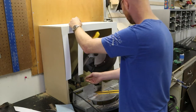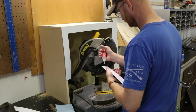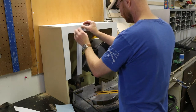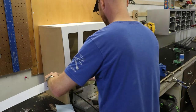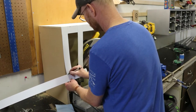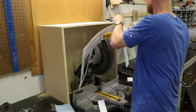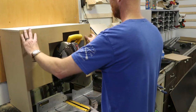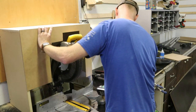From this angle you get a better idea of what I'm talking about. At the bottom I want enough room to put my hand behind there and adjust the fence or anything in the back. On the top and direct sides I need enough room for the saw to come through at any angle — I'm just eyeballing and double-checking that. Once I had that template done, I took it over to a piece of melamine, put it on the back side, and now I just screw it in and I'm done with this part.